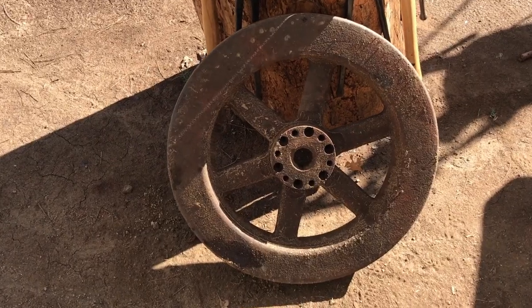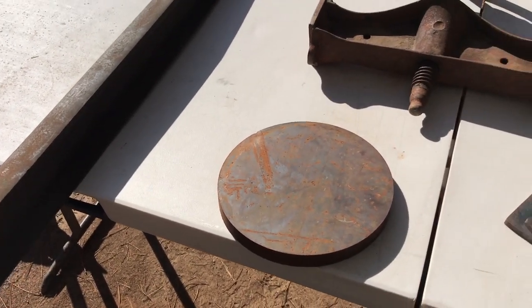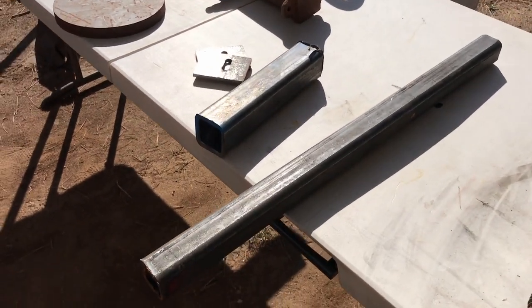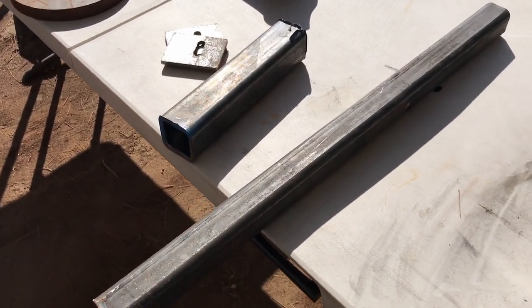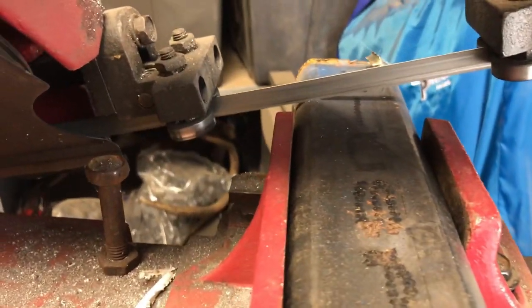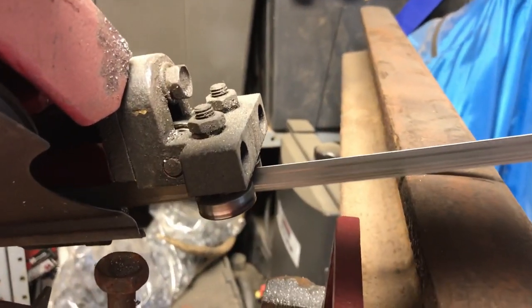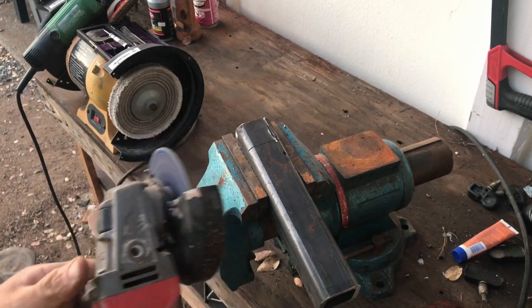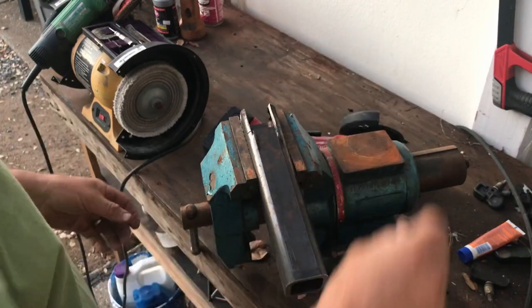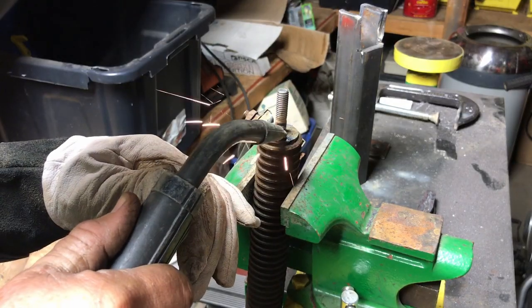The goal is to mount this heart and soul piece to these rails and fabricate a way to hold dies. This large wheel will be used as our base material since it is very heavy. These pieces of track will then be welded to the wheel, and between the tracks will be the wine press. This receiver and extension material will make up the vertical sliding portion. We cut these to length on the bandsaw, followed by some chops of the track on the cutoff wheel. Notches were cut in the end of the extension tube, and a quick touch on the Rockwell 6x48 and she's good to go.